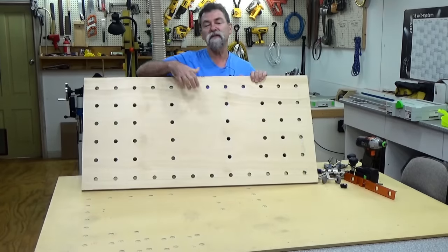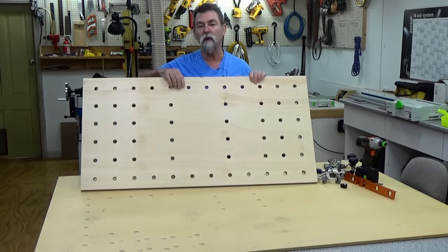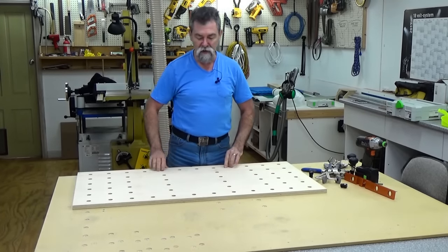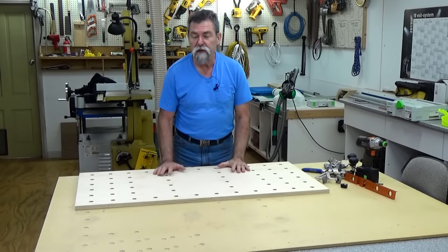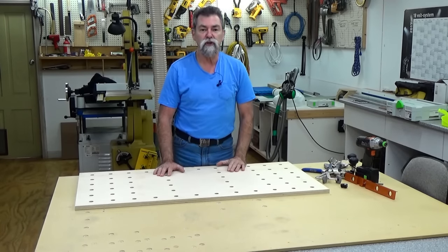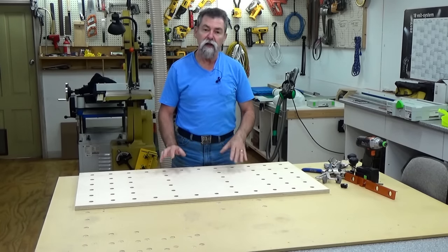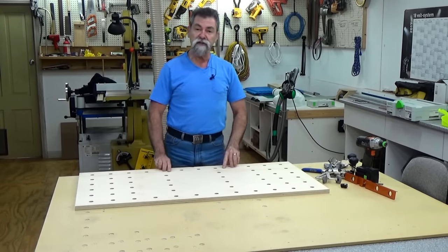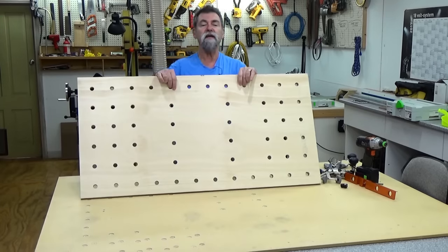You may also notice that I haven't dog-holed the whole board because I don't want to drop screws and things down there. So I'm going to do some interesting things with this. The board that I'm using for this is three-quarter inch hoop pine plywood, close enough to 19 millimeters thick. It's nine ply — pretty stable — and I purchased this board as a quarter sheet.